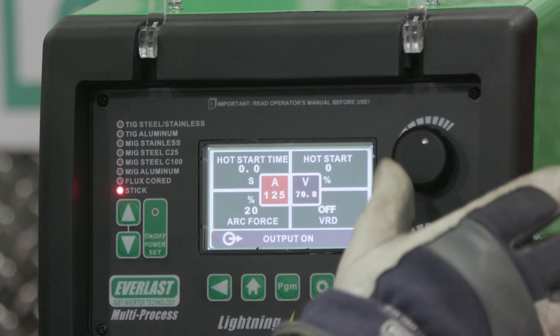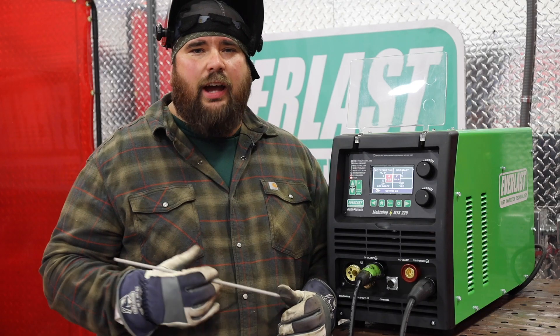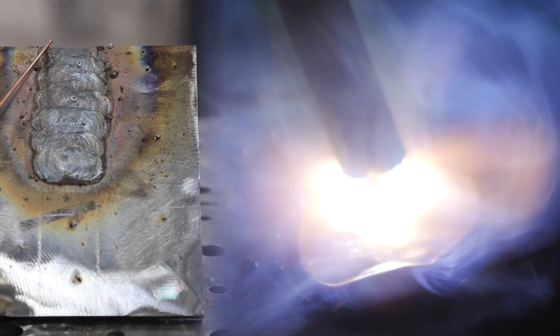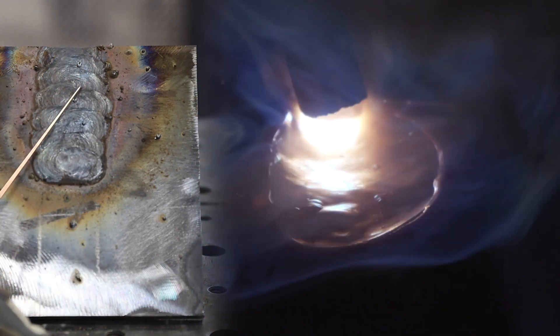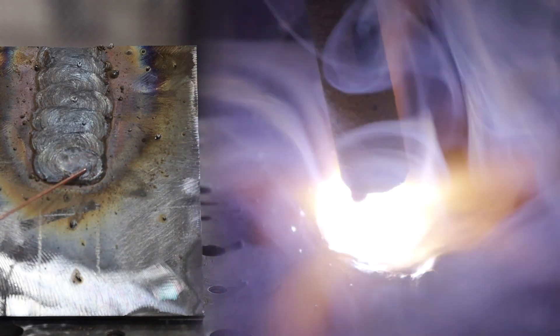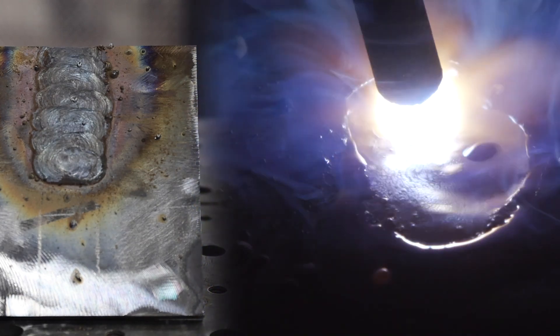I'm going to make a wide bead on flat plate and turn the amps up. That was at 125 amps; now we're running at 160 amps. I encourage my students to learn the limits and see what the material can handle — that teaches you in the long run. Let's run hot and slow and see what happens. At 160 amps, right on this edge — that's pretty good proof this three-eighths plate will handle it. Look at the end crater: we're wide but we weren't even close to blowing through. I'd encourage anyone learning to stick weld to try this exercise — it really puts everything in perspective.